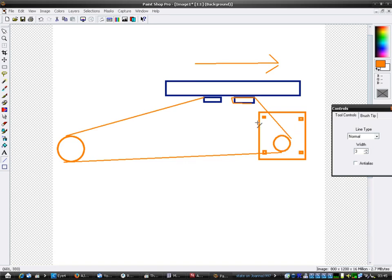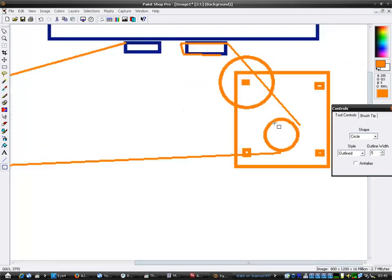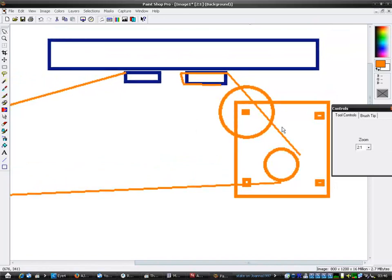So what I decided to do to correct this problem is to put a pulley, right? To put an actual pulley. Oh, that's wrong, in the wrong place. Is to put a pulley there, right, on the end of the motor, so the belt goes up. Sorry, I need to. This is messy now. But instead of the belt being at an angle relative to the table, the belt will go around this pulley and it will be directly parallel with the table, so it will be more straight, if you know what I mean.